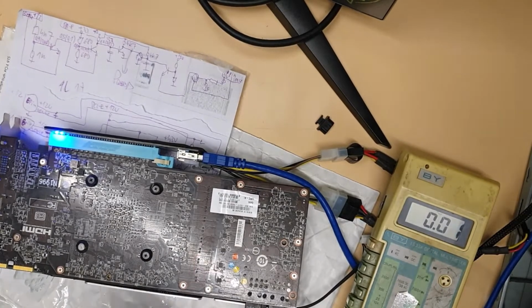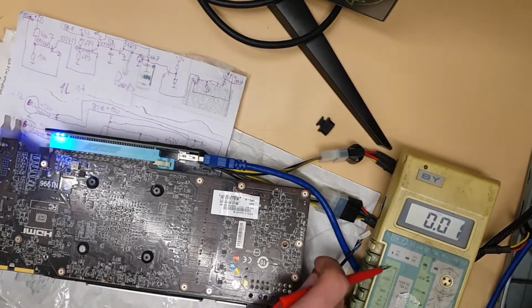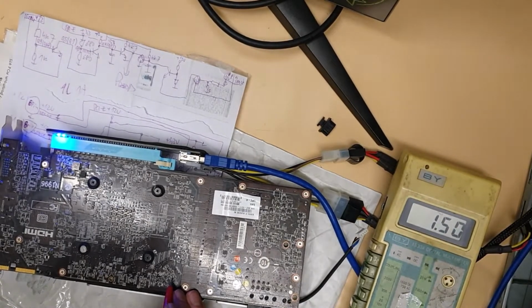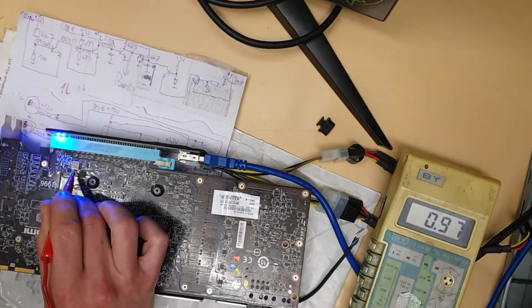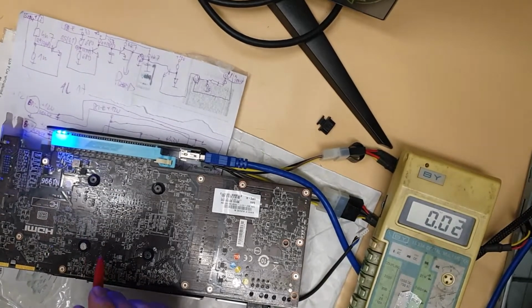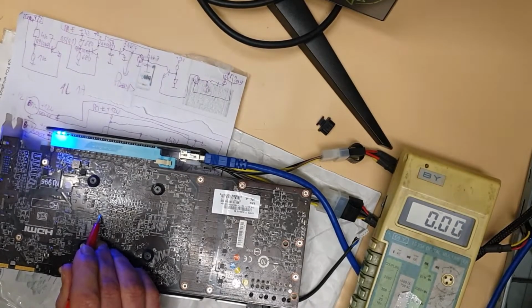And yeah, we got a screen, so obviously you're gonna have core voltage 0.94. One important thing is when you measure like this, you see I got the fans from the bottom, so I unplugged the fans just to avoid the damage. At 1.5 you see this is 1.97, I think that's some display rail or something like that. And somewhere here should be 1.8,